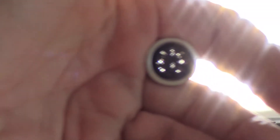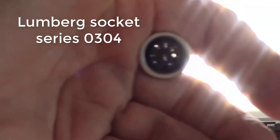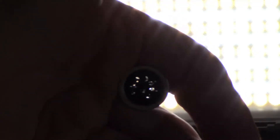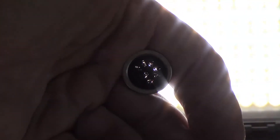Looking at the socket against the light, you can see that it is see-through through all the pins. Now, that doesn't matter because there isn't water on either side of the pins, or shouldn't be. But it does mean that if you were to remove a plug from this socket with water all the way around the annular gap, it's going to get wet everywhere even before you install a cap. So it's not very satisfactory. At least we've established that the box is no good, and that the Lumberg connectors are not much good either.